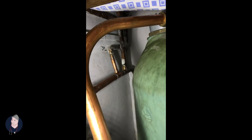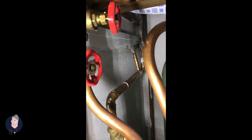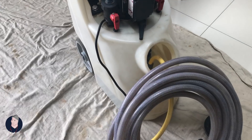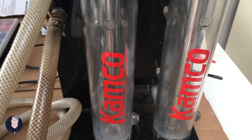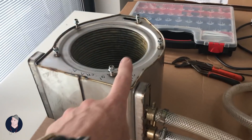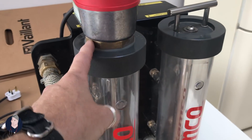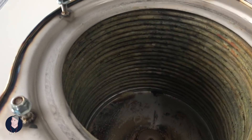So that's a new feed from the tank, and we're just going to open it up and check it. We've got a power flushing machine set up — twin mags, heating element on the other side. And would you believe it's a 31-kilowatt heat exchanger. I'm going to power flush this and we'll see what it does — turn the heater on, which will then activate the chemical a lot quicker, and give the inside a bit of a clean.